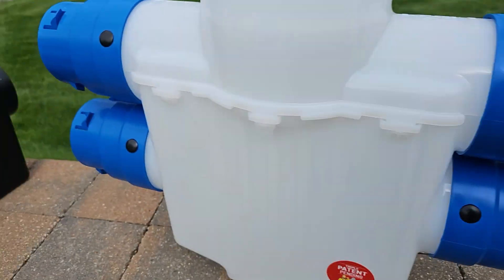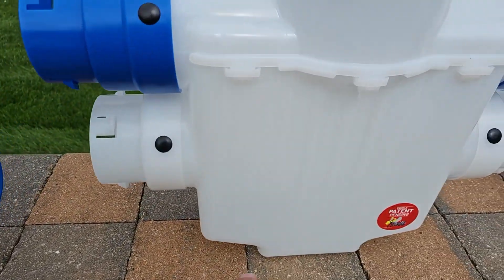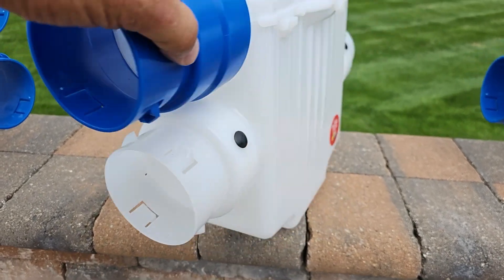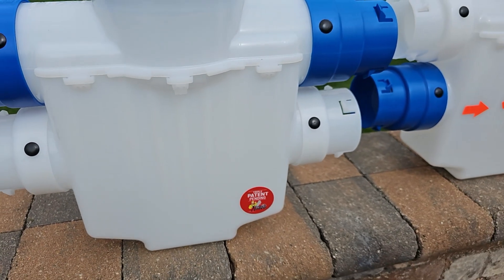Pickaxing that in, this big bucket — and then it doesn't have the sump capacity. Now this right here has two and a quarter gallons of sump. It's only five inches wide, and it fits in a trench made by a trencher. You can go to the rental store, trench in your line, and all this stuff just drops right in.